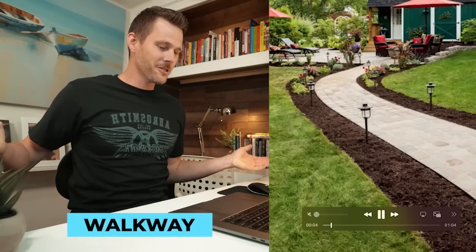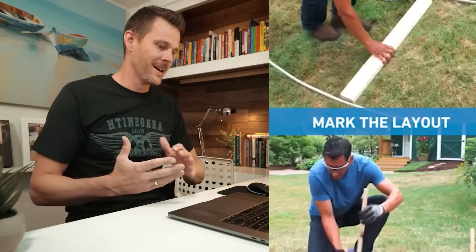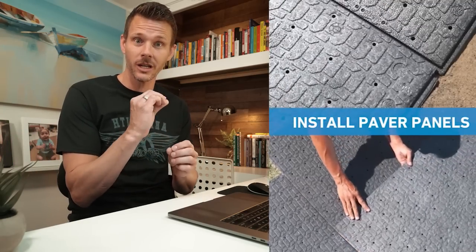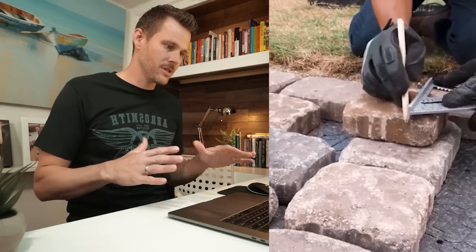Number seven is a really cool video put together by Lowe's that shows how easy it is to put in a walkway or path — it's got all the different steps. The reason it's important for you to see what goes into this is so you can decide whether you want to do it or hire somebody. A couple of things aren't 100% how a professional would install it — like putting pavers on sand. Those days are kind of one and done. We do clean rock and then 3/8-inch screening, and then set on there, because sand moves around a lot.